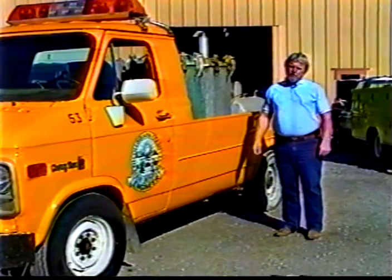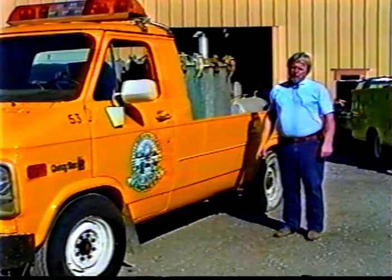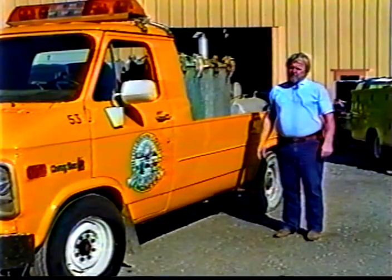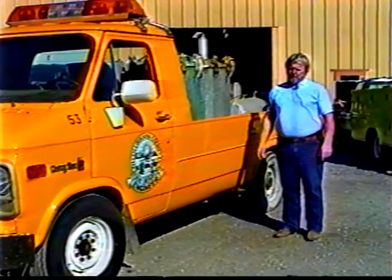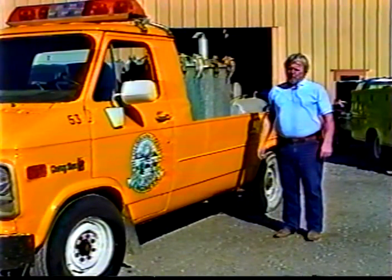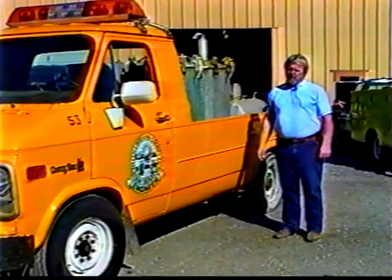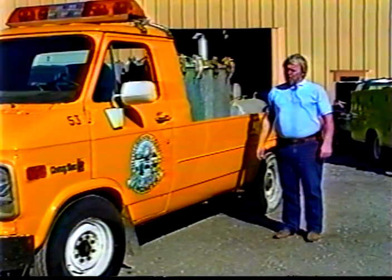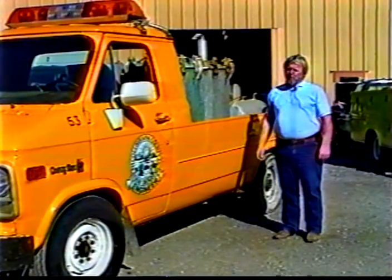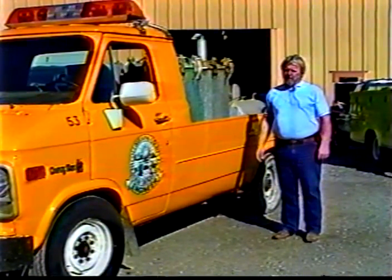We do use a lead truck with this machine whenever we're doing center line. The lead truck, of course, has a sign on it that says line striper, head and arrow, telling them to keep to the left of the striper of the oncoming traffic. Also, in that lead truck, we haul the excess beads that we use for the day's work. When we are edge lining, we put extra beads on this machine and we edge line with one person only, and that's the operator of this truck.